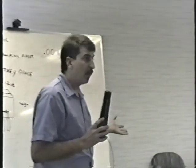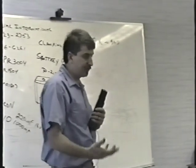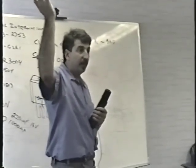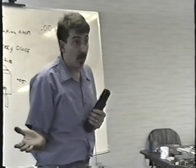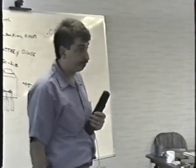You turn on the game, and it doesn't come up right away. You turn on the game and it just sits there, and then 1 minute later or 2 minutes or five or ten, all of a sudden, bing, the game comes on by itself. That's that capacitor going bad. Or it just never fires up at all. It just eventually gets so bad that the power supply never fires up at all.